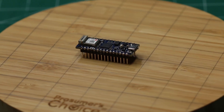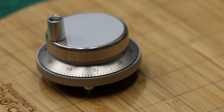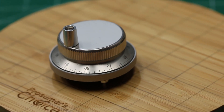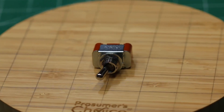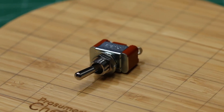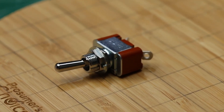I'm using the Arduino Nano IoT 33 microcontroller for this project mainly because it has the SAMD processor and that can emulate a keyboard — that's really the only feature I need, so it's perfect. I found a 60 millimeter rotary encoder for super fine control of the cut head. I should be able to bind each pulse to a keystroke and then set the incremental jog step on the touch screen. This toggle switch will act as an arming switch so I can arm and disarm the entire system, so I won't inadvertently bump the encoder or a button while the machine is running. I'm also adding an RGB LED to the top so I have a visual indicator of whether it is armed or not.